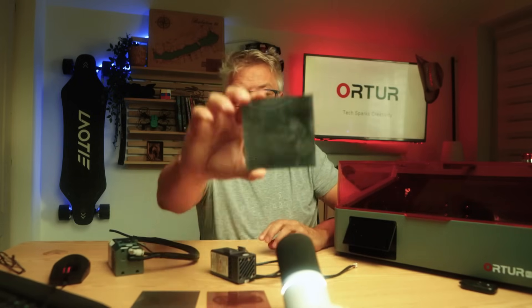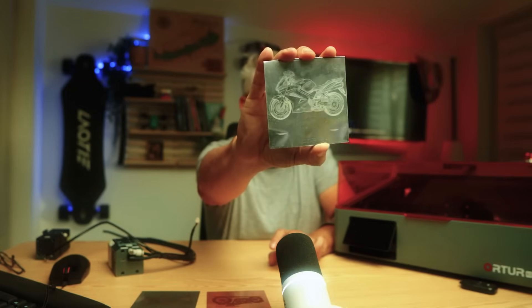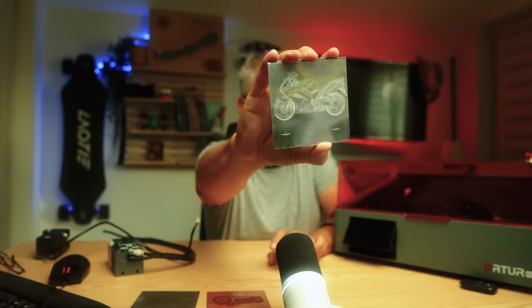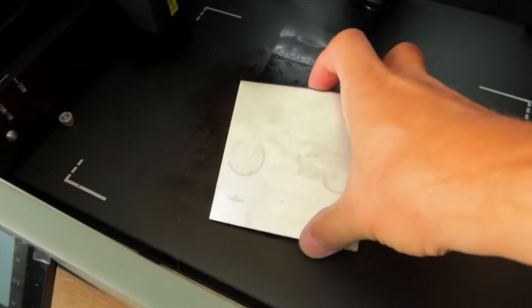You can see that there isn't much of a pattern on the aluminum, so I set the laser a bit stronger and slowed down the carriage, and the result got a little better — but it's still not perfect. The reason for this is that the aluminum sheet reflects light quite strongly. Even though metals absorb infrared light better, very reflective surfaces still aren't ideal, and the results don't look good enough that I would highlight this as a positive feature of the machine.